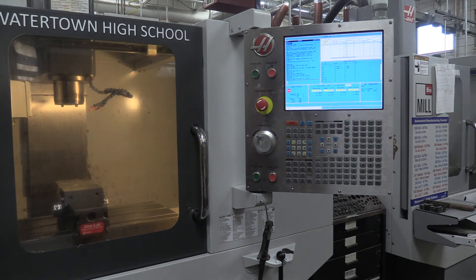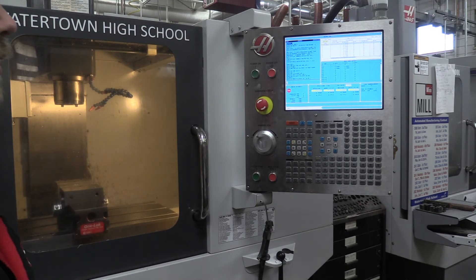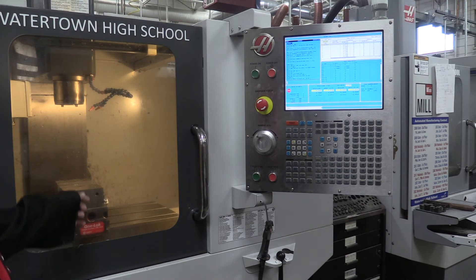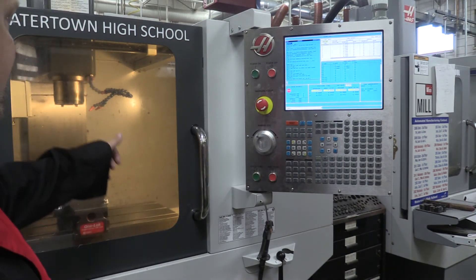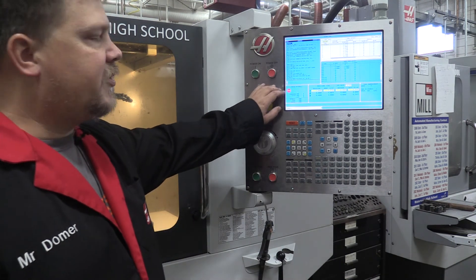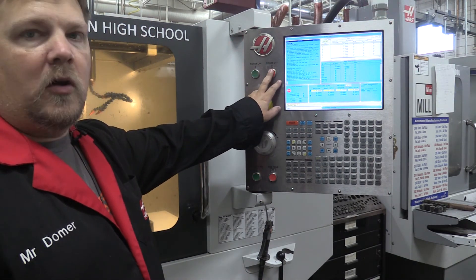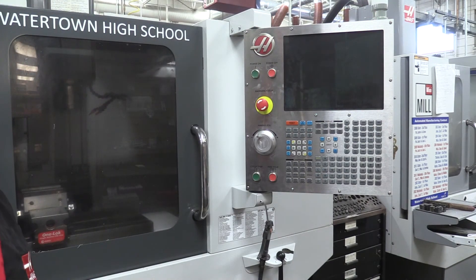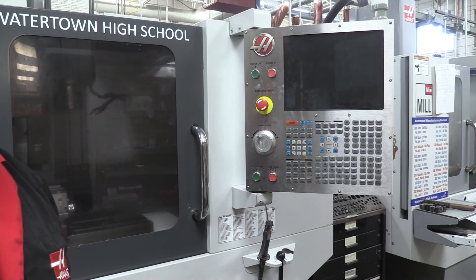For shutdown procedures — when we're done with the machine and ready to walk away — we're going to hit power up restart again to get everything back to zeros with no tool in the spindle. Then I like to hit the e-stop to release the servos and motors, and then hit power off. That's the practice at the end of each class period. We want to leave the machine with no tool in the spindle overnight, over the weekend, or over long periods — we'll cover that process when we get into tooling.